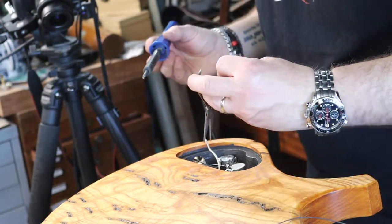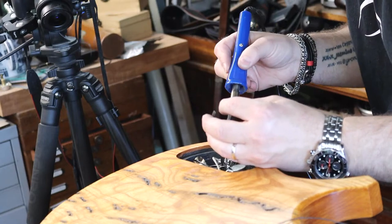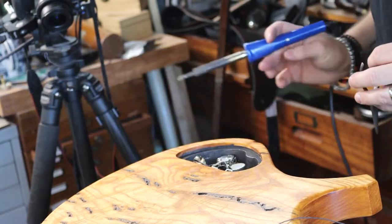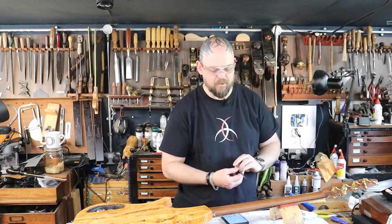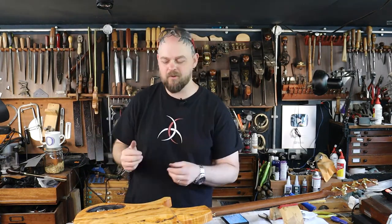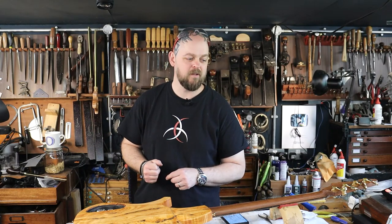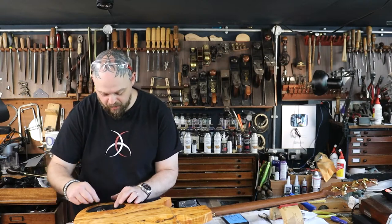Another soldering myth, if ground loops are a myth, is that blowing on solder to cool it down does anything bad. There's nothing wrong with that. There is a little bit of moisture in your breath, but that's not going to stick inside of the solder. We are not Superman. I'm not blowing hard enough to send my breath internally inside a molten liquid metal. Anything that hits the outside while it's still hot is just going to evaporate straight away. It's just not a thing.